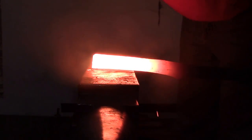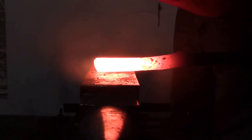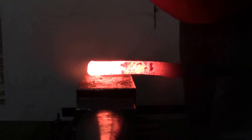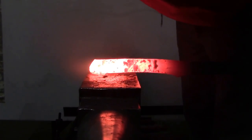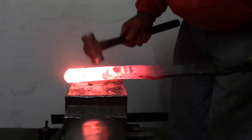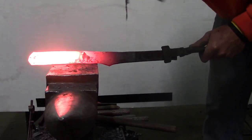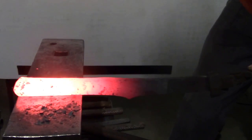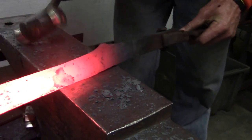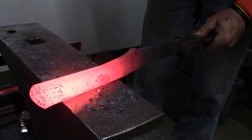All right, we'll make the heel. It's an upsetting motion. All right, we'll come up here on the horn and just kind of get that bevel started here at an angle. So we've got the heel. This is the outside edge. So I'm going to come right in here with my round side of my hammer, start it there, and then bevel all the way through the branch.